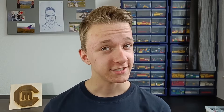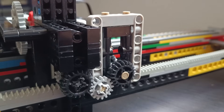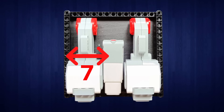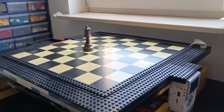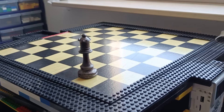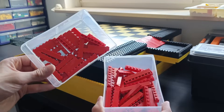Next, we're working on all the axes. The Y-axis will consist of two gear racks with a larger X-axis running over it. The X-axis will need to be a small mechanism with the Z-axis attached to it. It can't stick out more than seven studs to any side, or else it will hit the walls near the edges. If we encase this all in Lego, we should have a working mechanism. You can see the queen magically moves across the board — but with a visible mechanism, because I ran out of bricks for the walls.